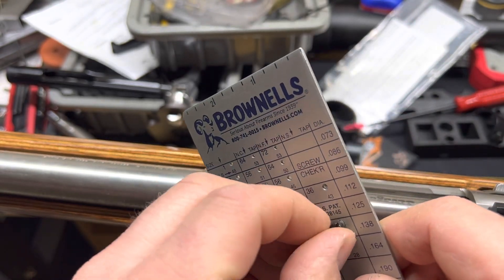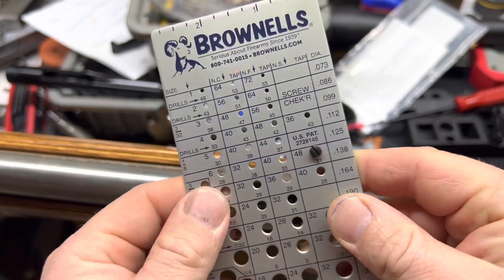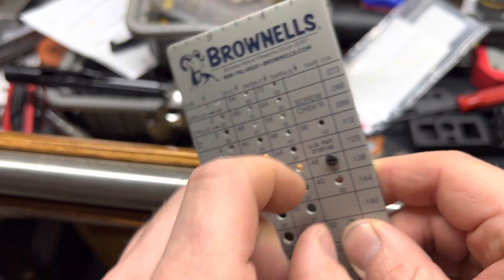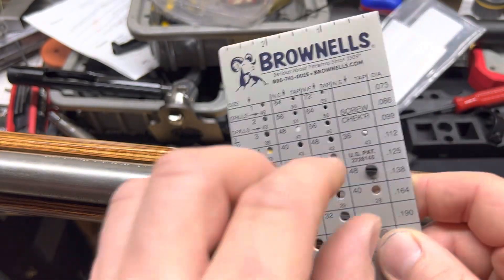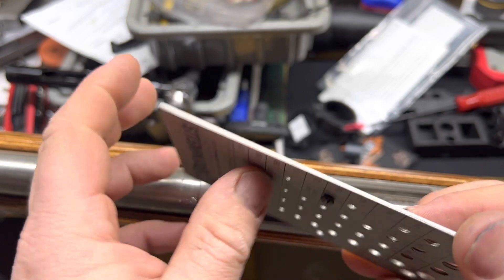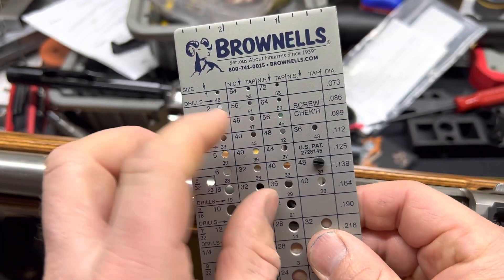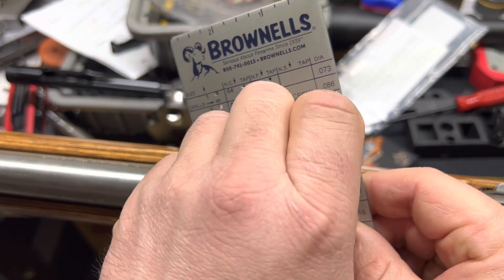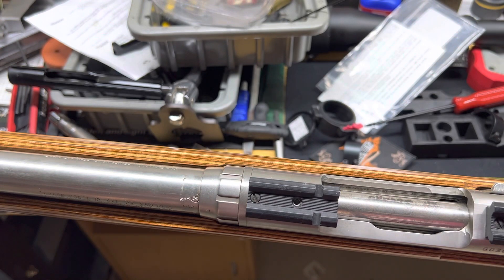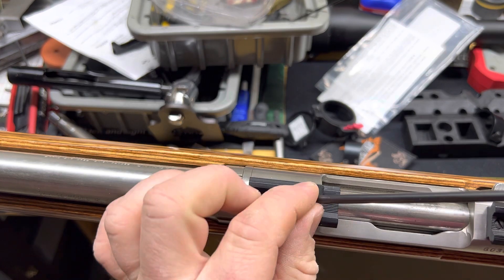One more thing — I don't know if I would do it often, but you could also use this for shortening a screw. If you needed to take some off the length because it was bottoming out, you could screw it in here and leave exposed the amount that you wanted to remove, then take it to your grinding wheel and grind that flat. Being that you have it in a threaded hole, when you back it out it's going to take the burr off the thread, and you'll have a screw that will easily screw back in. Not that I need to do it on this one, but that's a nice added bonus with that screw checker.